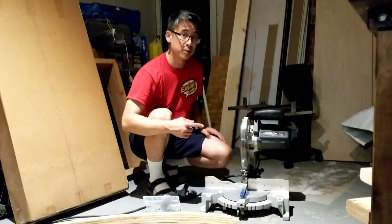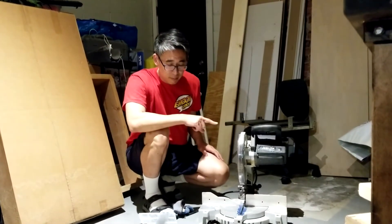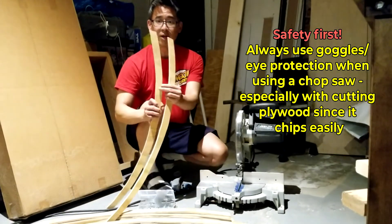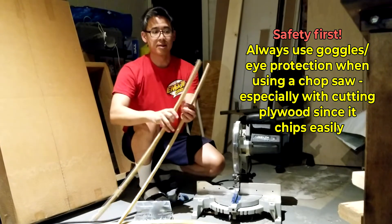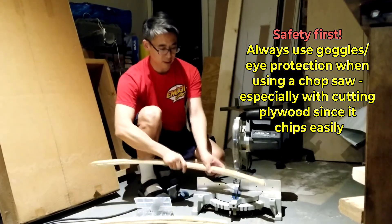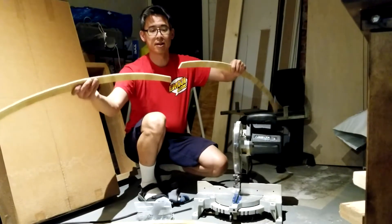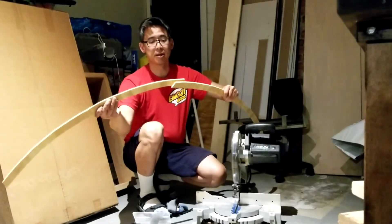The next part is much easier with a compound miter saw. You'll notice the edges of the chord pieces are straight — that's not what you want. You want the edges cut at an angle so the pieces connect together. Cut them normally and when assembled they'll form a proper circle rather than a double-rainbow shape.